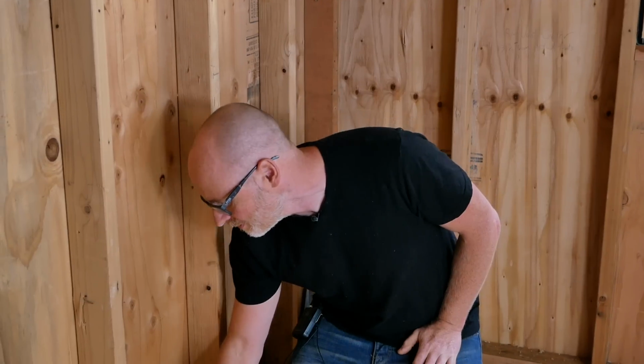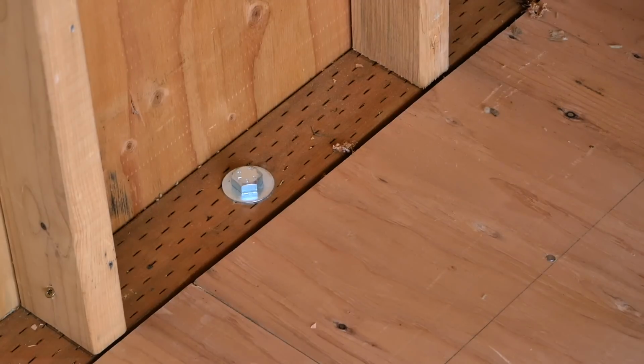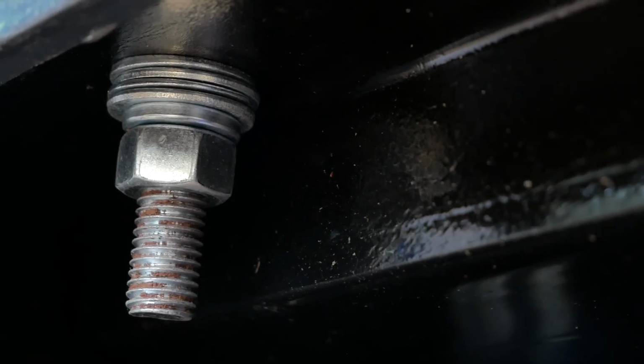Using pressure treated down here meant we needed to use special fasteners, and also the pressure treated was a little bit oversized, which pushed a bunch of small errors into the frame. And overall, I felt like, even though this is more rot resistant, I'm not sure that's a real concern, and it just created enough hassles that on my next frame, I'm going to go with standard lumber for my sill plate.